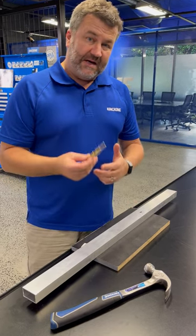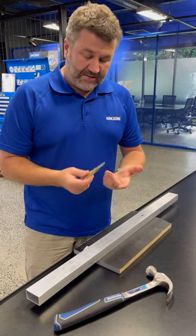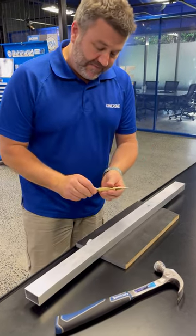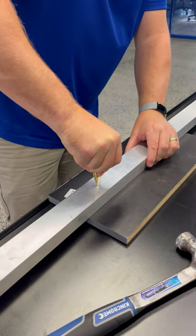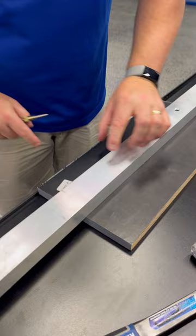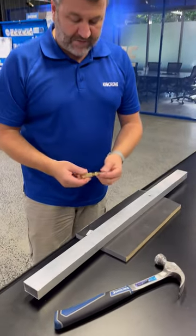The beauty of this is you don't need a hammer. You do not strike this. It's got a spring-load tension in the center and once you've wound it up, you just push it down and it releases, leaves a little mark, perfect for drilling. That'll start a drill bit and it won't wander all over the place.